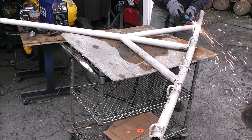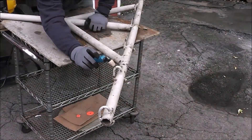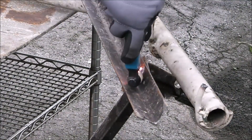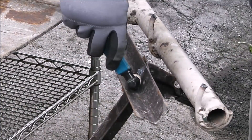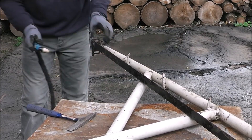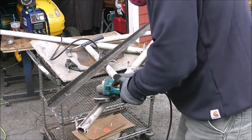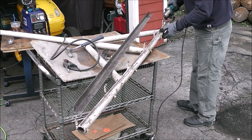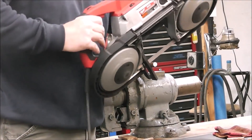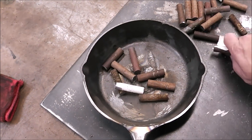Here I am — this is a good plasma cutter project just because I can burn through a lot of this stuff. I'm cutting off those hooks and they're approximately about 2 inches long. Those hooks I'm going to leave in place — they're actually going to be tines that dig into the ground, in addition to the ones we put on. Now I'm just gouging off these rivets off this bed frame. This is going to be part of the backside scraper blade, and I'm using the hammer to get these pieces separated. For the other side I'm just cutting it off to length — the plasma cutter makes really quick work of this.